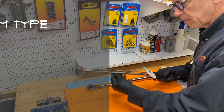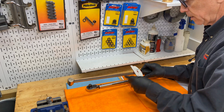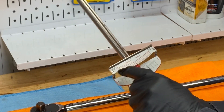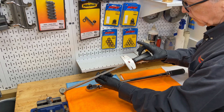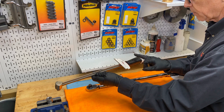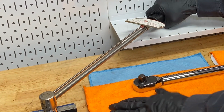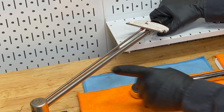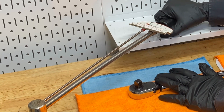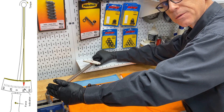There are a couple of types, and this deflecting beam type is the best one to show how they work. It has a beam that bends and an indicator bar that stays in one place, calibrated to read on this face in foot-pounds and newton-meters. The handle has a fixed point — that's why it wobbles — so you pull at the exact fixed point. This lever is probably 24 inches, two feet. When you pull, the bigger bar bends and the top bar stays in place, and you read out the foot-pounds at the gauge — 60 foot-pounds. I was probably pulling about 30 pounds of force, because 30 times 2 equals 60 foot-pounds.